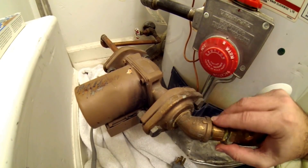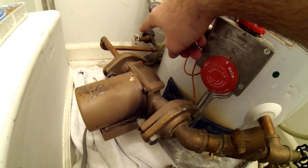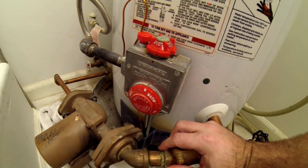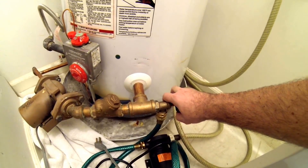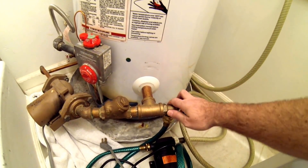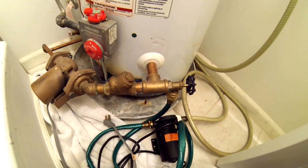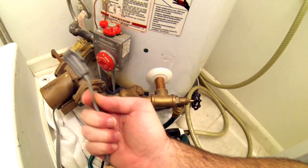I'm going to get this all ready to replace — I've already done five things. One, shut off that valve because I don't want the water draining back from all the fixtures. Two, I've turned my gas to pilot so I don't start up the burner on my water heater when it's empty. Number three, I've shut off the cold water coming in because I don't want the tank refilling after I've drained it. Number four, I've drained the tank — you could use a standard garden hose; I use a little sump pump which empties the tank in 15 to 20 minutes. And number five, probably the first thing you should do when you realize something's wrong: unplug the pump.